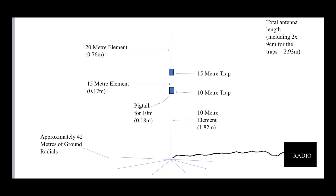The lengths are pretty much shorter than normal quarter waves because the traps provide some loading. On 10 meters, the element is only 1.82 meters long. Usually the 10 meter element would be about 2.2 to 2.3 meters, maybe a bit longer. So the trap provides some loading. The 15 meter element, including the two traps and 17 centimeters of wire in between, is also quite short overall, as is 20 meters.